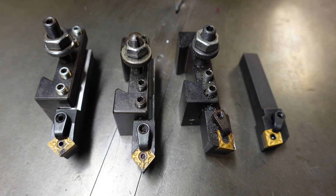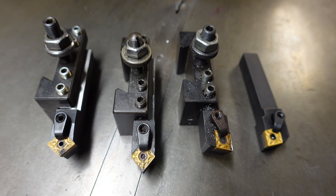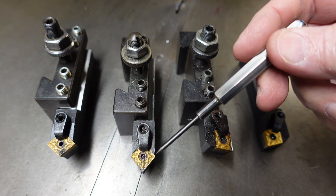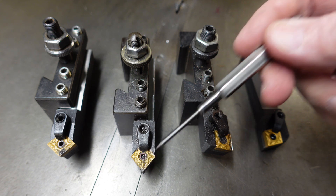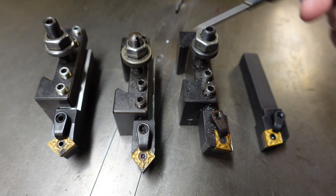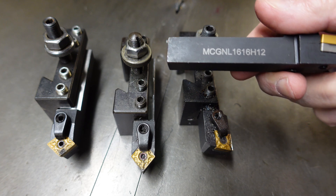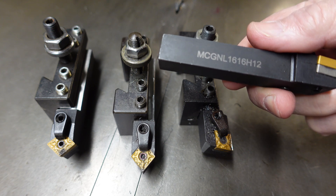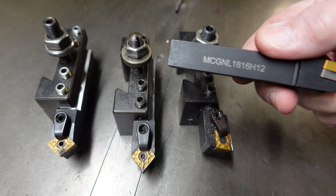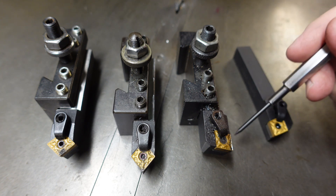Here's the set of tool holders with the different directions the inserts can be oriented - left to right - and there's a different degree angle you can use. The cool thing is there are basically eight cutting tips because you can turn the insert over and use the bottom side. These are AXA tool holders and this unit here - it's a 16 by 16, I think that's millimeter - is too large for the AXA tool holder, so I need to cut about a hundred thousandths off of it to fit. You can see they're quite dirty; I've been using them.